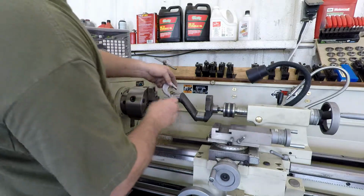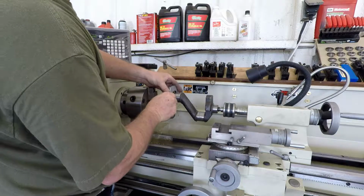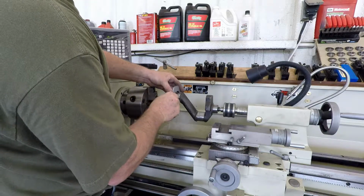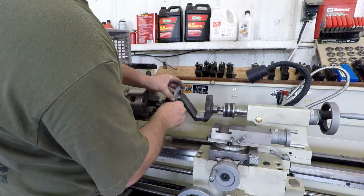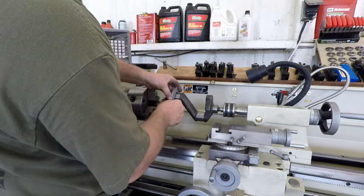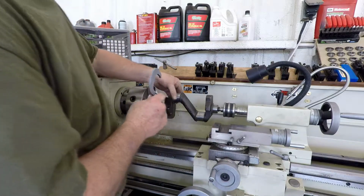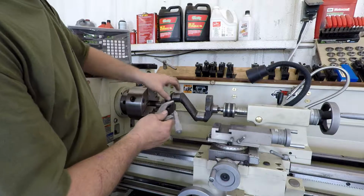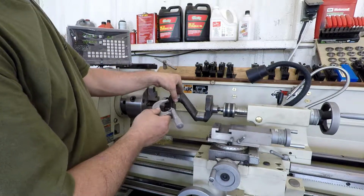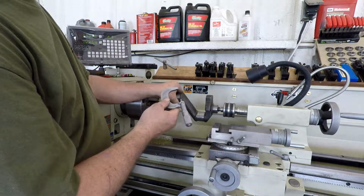So we're about 1,000th under 5/8, 1 5/8, and that's pretty true both directions. You know, we're pretty round actually. We're within, for sure, within 1,000th or half a thousandth being round. So our final number we can call 1.624.